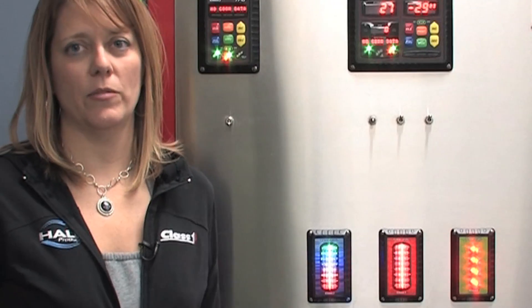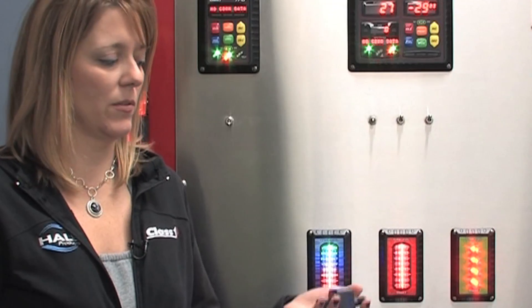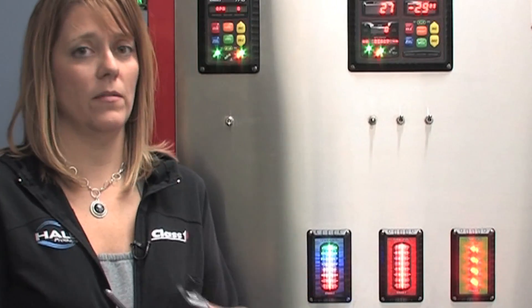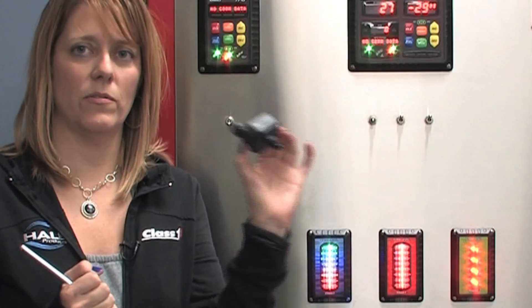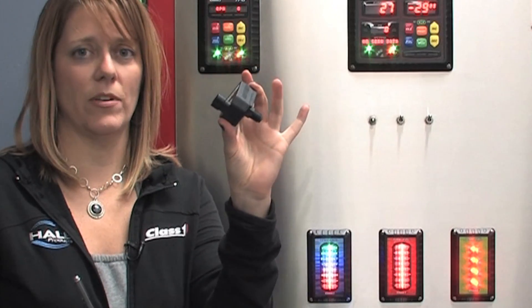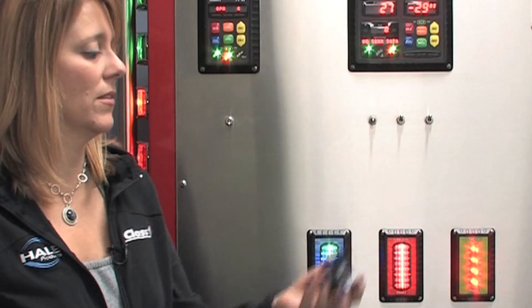For a 2-point calibration starting with a full tank, we have a different calibration sequence. Here's a little trick: if your water tank is already full, you can unplug the harness from the pressure transducer in your tank and plug it into a second backup pressure transducer. This simulates an empty tank situation, saving you from having to actually empty your water tank.